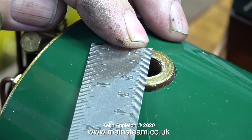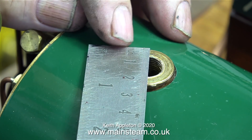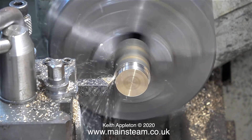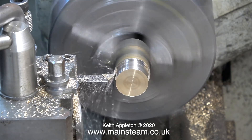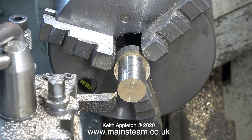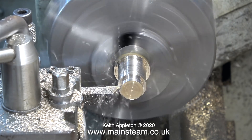Now it's time to make the turret. It's 2 centimeters in diameter — or is it 13/16ths of an inch? I think it's 2 centimeters. Whichever it is, the part needs to be made to this diameter. Over to my Boxford lathe with a piece of phosphor bronze in the chuck, I'm reducing the diameter to 2 centimeters. I thought it would be better to use phosphor bronze rather than brass because it's stronger, and besides it will look better. In no time at all I'd reduced the outside diameter to 2 centimeters. Now I need to reduce the diameter further down to half an inch, after which I will cut a thread — half an inch by 26 threads per inch.